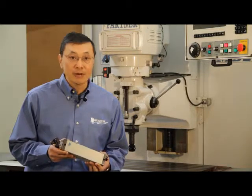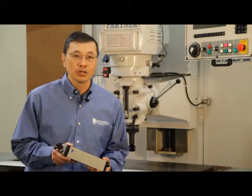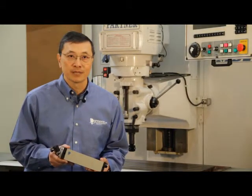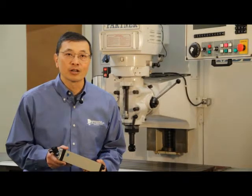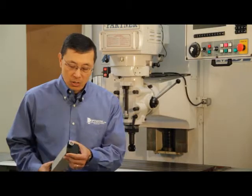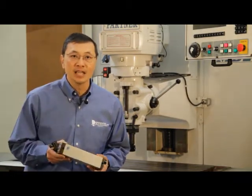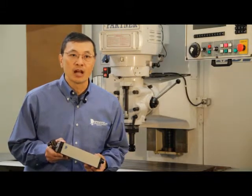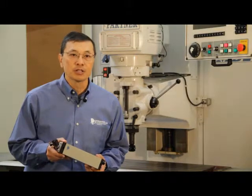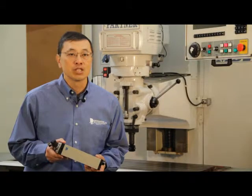The MCV500 is the industry leader for machine tool calibration. It is simple to use, compact, and accurate to better than half parts per million. We call the MCV500 laser our 2x2. It is the smallest in the industry — 2 inches by 2 inches and 8 inches long. The design and engineering is based on form follows function. It is also the most flexible and can be fitted with add-ons to measure all 21 machine errors.